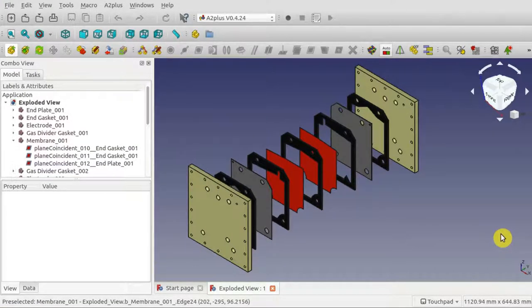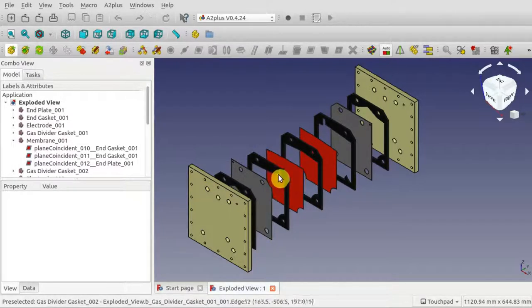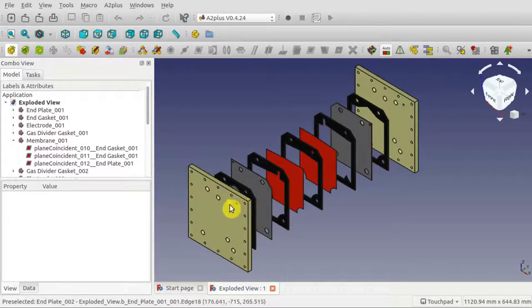Here's how it works. At the core of the cell are two electrodes, and between them is a sodium hydroxide solution. The electricity passes from one electrode to the other, and when it does this, it splits the water in between into hydrogen at one side and oxygen at the other side. The two gases can never combine — the hydrogen goes up into this channel and can pass through these holes, while the oxygen is formed here and passes through this part, but never mixes with the hydrogen.